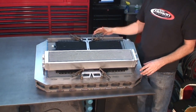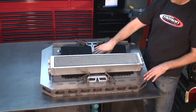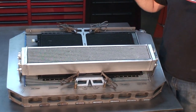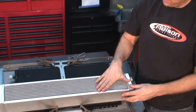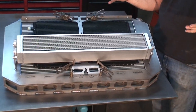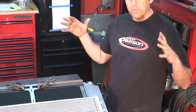We've got a 36-inch long radiator with twin 16-inch fans and a really nice AC condenser with a custom bracket. Right here is a radiator for the intercoolers - we've got two water-to-air intercoolers hidden underneath the fenders that run through this radiator to cool them. All of this is packed into this custom core support. The thing is actually going to drive on the street - it's not just a big motor screwed into a car; everything is thought out.